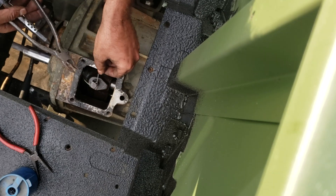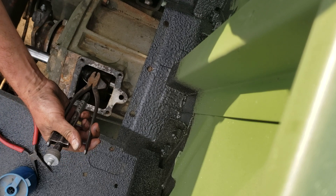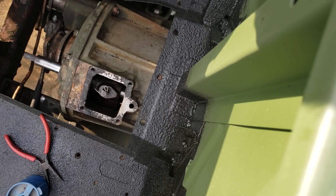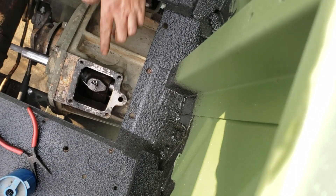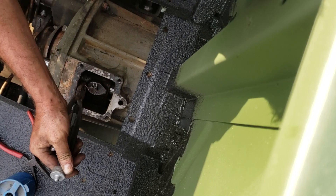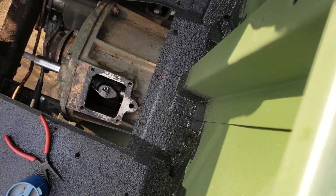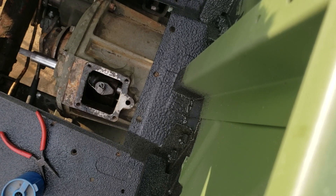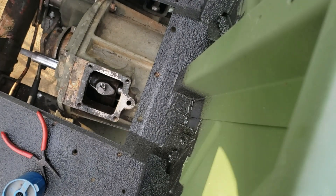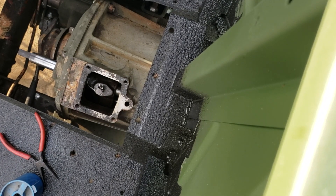So what you do now is take these ends and snip it off. Then a professional will twist the end back around like so, so that nobody gets hurt on it — that leaves a very sharp end. Let's see if I can put a little bit of a twist in it to keep it more snug. Yeah, that should help. Either way, that bolt's not coming out now. I don't really like how it's supposed to wrap around the shaft like that, but it's the way it was built. Anyway, that's how you safety wire the retainer bolt on a Rockwell transfer case on the high-low range shift rail.